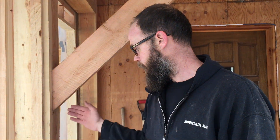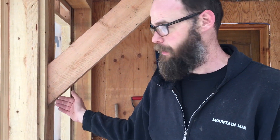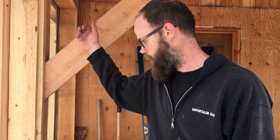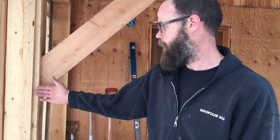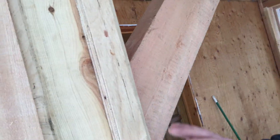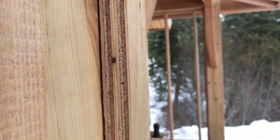I don't like to bring drywall or other things right up to the timber frame because that's going to move and shift and probably shrink, and that'll just shrink away from any plastered edge, or even if you were to put trim on it, it's still going to shrink away from it. So I just like to duck behind and give a little adjustment and shrinkage space back there. I used two layers of half-inch plywood screwed right to the timber frame, and that's what we'll be screwing the wall to.